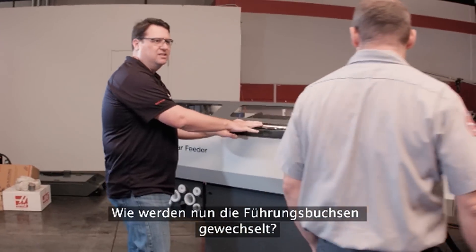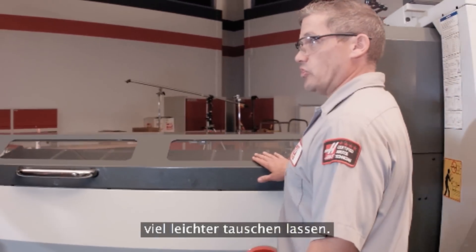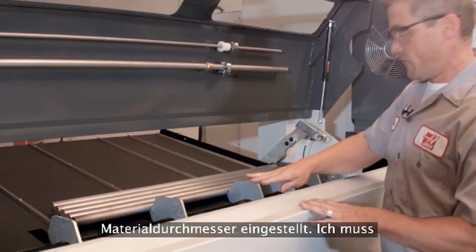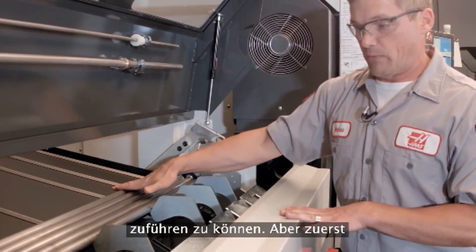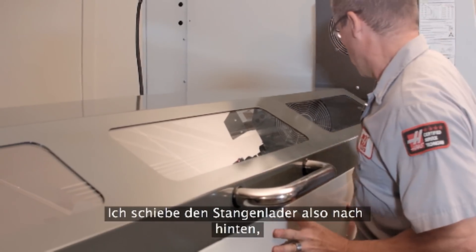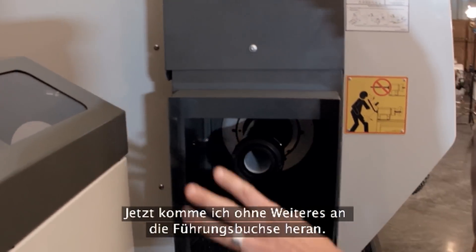So how does it go for changing liners? It looks like that's going to make a liner change out a whole lot easier. Yeah, super easy. In fact, that's what I was going to do right now. The transfer tray here is set up for this large diameter material, and I need to raise that up when I'm getting ready to feed this one-inch diameter. But first, I need to change the liner. So we'll push the unit out of the way again, just like we did before — that gives me complete access to the liner.